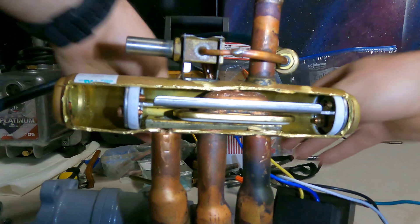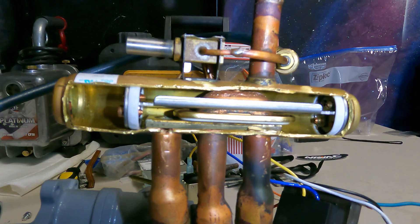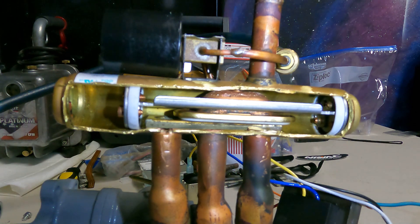Now in this instance, we don't have power applied anymore. If you wanted to test to see if you had a weak solenoid coil, you could take a magnet and do the same thing — the magnet acts as our solenoid coil. I'm out of nitrogen at this point, but that demonstrates the principle.